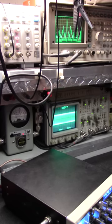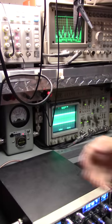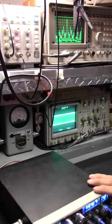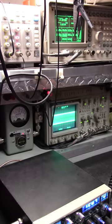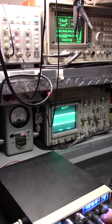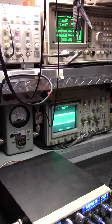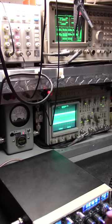Let's see what frequency we're actually on. Yeah, these are touchy. Well, I got it dialed straight up and down, and it's going to change by temperature. But let's just take a reference. These for sideband are rough because of that. 27204481. Let's put it back at the same spot. Try to. And see, now it's on. That's the problem with these. When we go back and forth again, look at it for straight up and down.